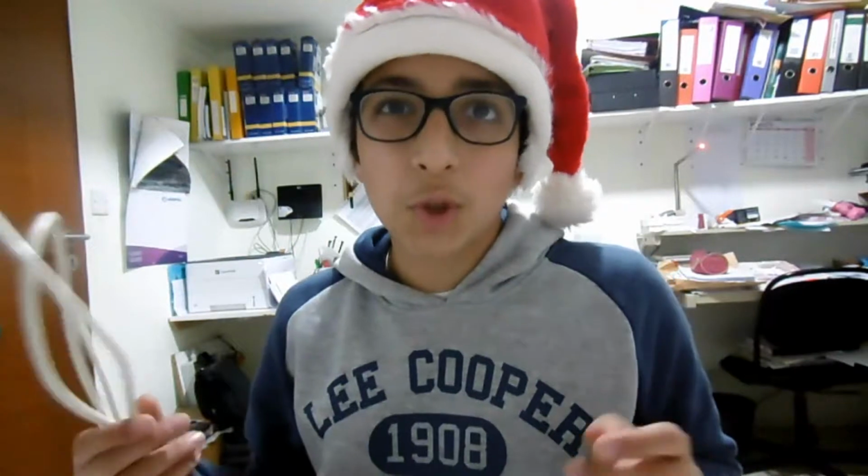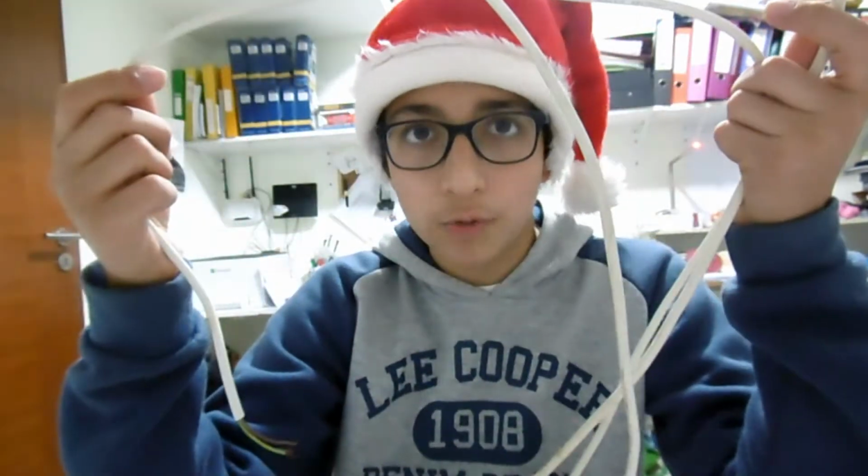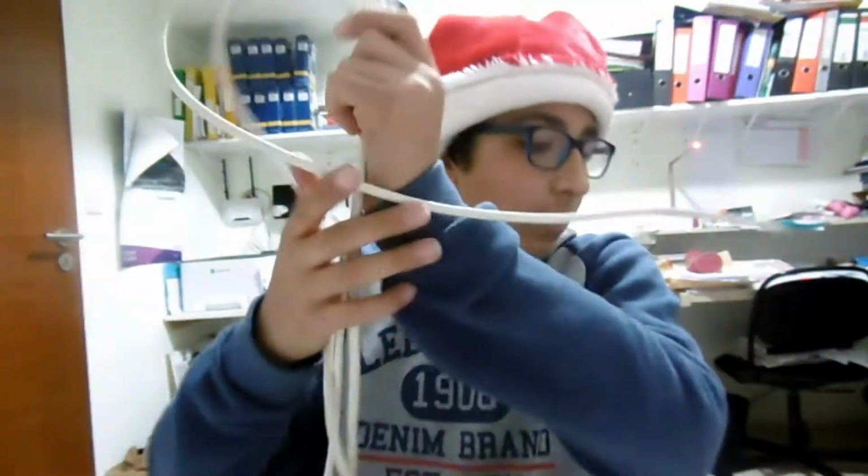Watch. So to make the Christmas lights, we need some lights from old Christmas lights. I have to cut them out. Some Wagos, for safety's sake and for a good connection, and some wires from old electronics. In this case, I got 2 wires from 2 old fans. The more lights you want, the more wires you need. And I also have to get 1 more light bulb from Christmas lights, because 1 burnt out in my experiments.